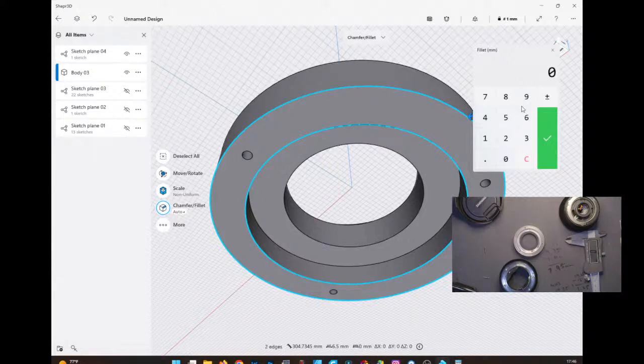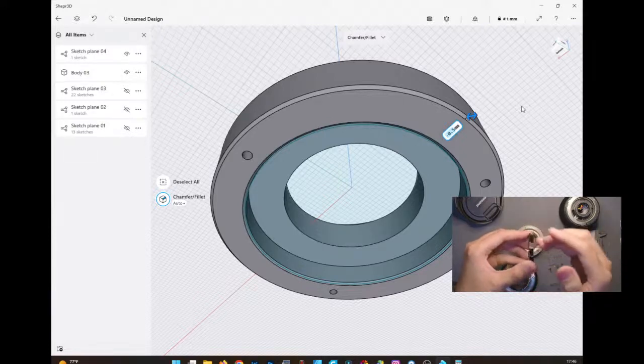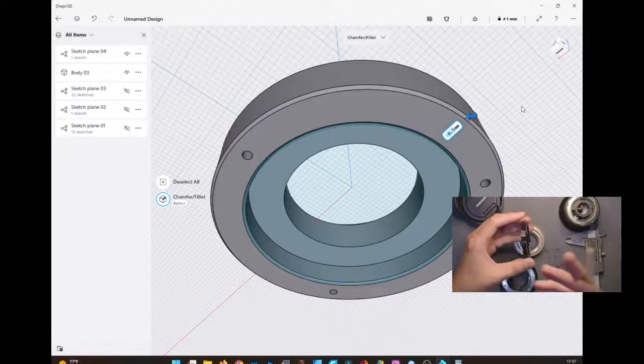Once you start printing, you'll run into something unavoidable that everybody runs into, and that's elephant's foot. So adding a bevel on the part where it's going to be facing the printer bed mitigates the effects of elephant's foot, but also I find it makes a much cleaner print. For example, this came off the print bed, and you can see that bevel, and you can also see the wall is straight across the board. There's no bulge, right? So it doesn't go like that, which is what elephant's foot would do.